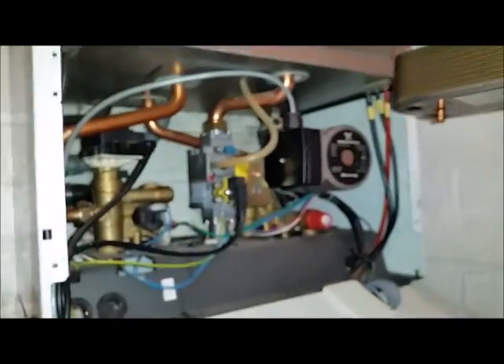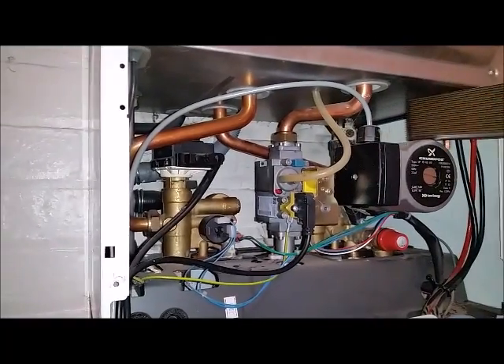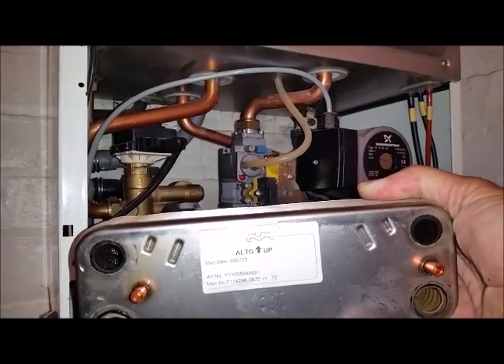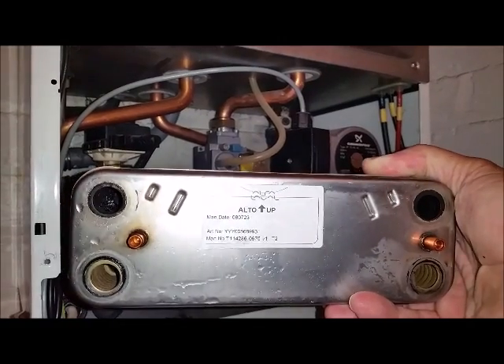This fits in the back of your boiler over here. You have to take it out at that angle above the pump. You go back in that way, then turn it as you get inside — it's got to be upright like that, top to top. I'll show you when we get it clean and when I put it back together again. But this is easy, it's a piece of cake.